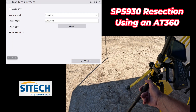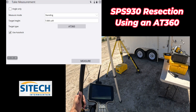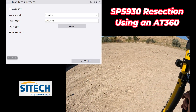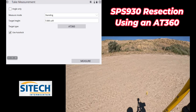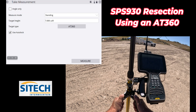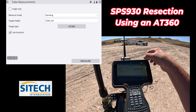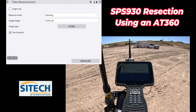Once I'm good there, I'm going to slide my legs up. Usually if I'm close enough to the total station, I'll set this out in front of it and get kind of where my light is. You can see that light starts flashing fast. Walk over to the control point and set up on it. It doesn't matter if you're facing the total station or not. But if you haven't turned the lights on or understand how that works — there's a button in the top right of your site work screen that shows a lock and a total station. If you click that, it takes you into a menu where you can change a couple of things.